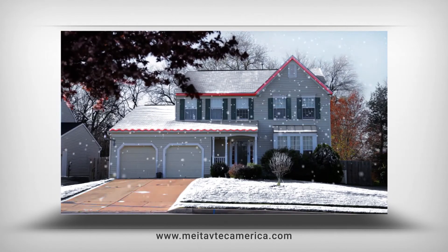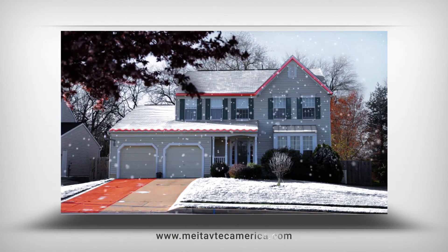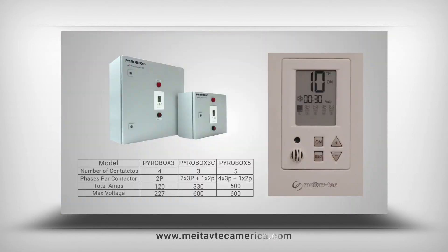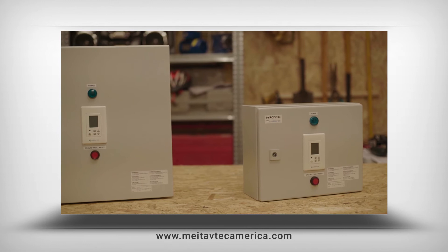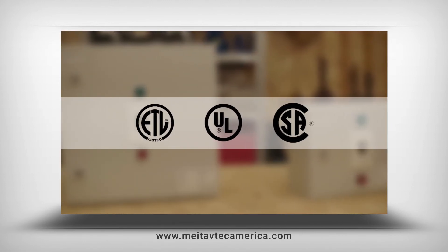The Pyro-X has several zone control with optional staggering, allowing large area coverage for snow melting with limited available power. Adjusting the time and number of zones is easily done by the local installer or end user. The Pyro-X system complies with NEC requirements, UL, and CSA standards.